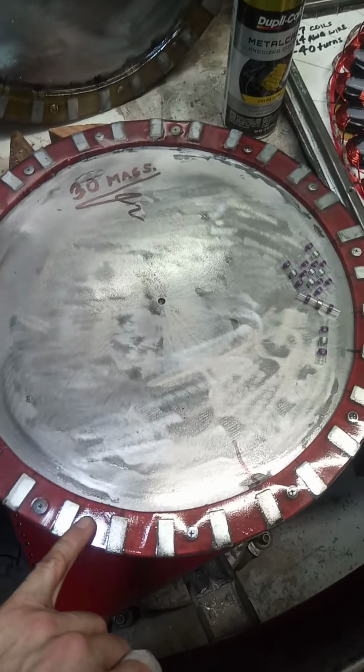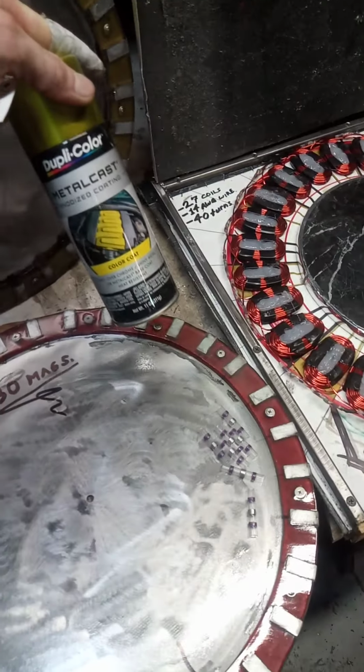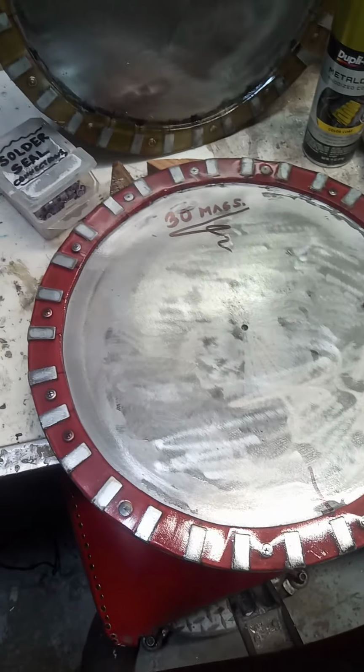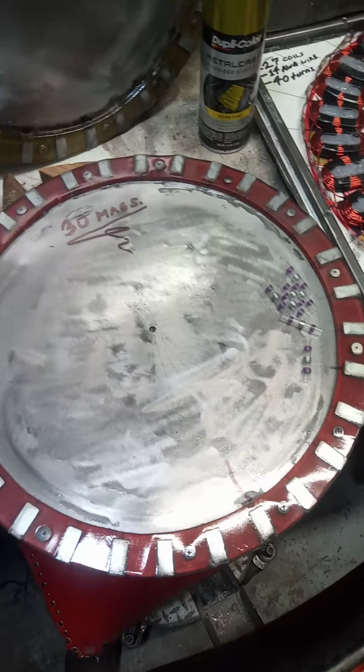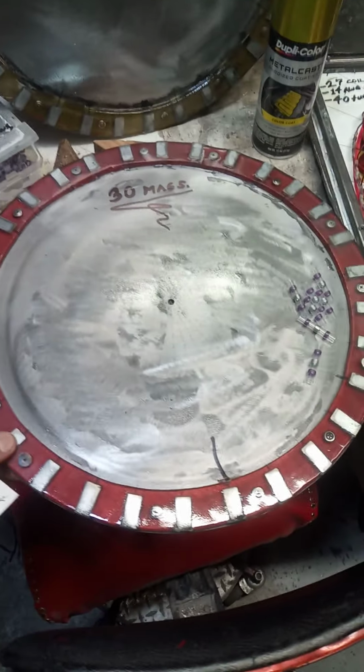When I did the epoxy, I took paint, I used this kind of stuff, and I just tried it out and it actually worked really good in the epoxy when I cast them. I sprayed a few sprays, not much at all, in the mix when I was mixing it. I had a red can and tried the yellow out in there, and it came out pretty good. Looks kind of cool. After I cleaned them up, I clear coated them with some real good automotive clear coat.